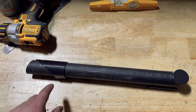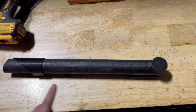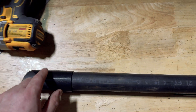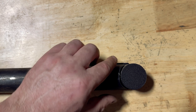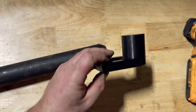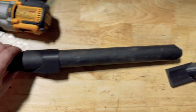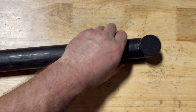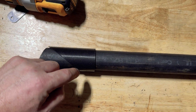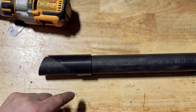This is how you get the exact right angle for your cut. I've got two 3D printed templates and I'll link to them in the comments so you can download them for free. They both have flat bottoms, so all you have to do is put it on and look until you have that arc lining up. Because they have flat bottoms and sit on top, when the arc is lined up it will be completely square and you'll have the exact 55-degree angle you need. Just mark it out and cut all the way around.